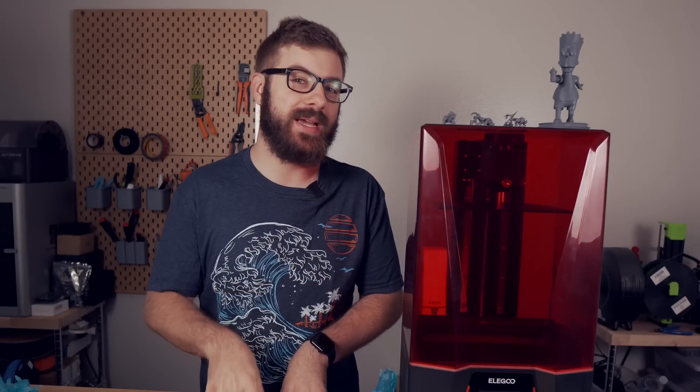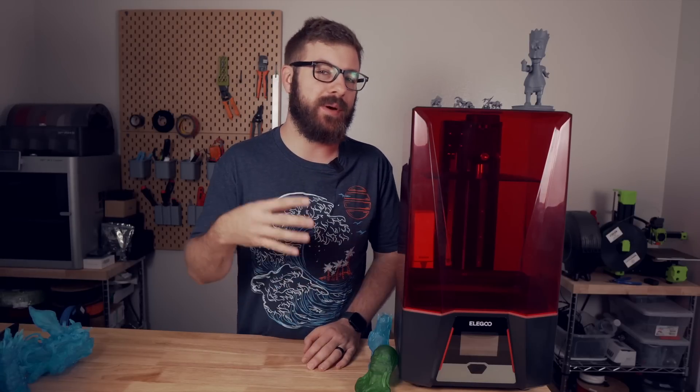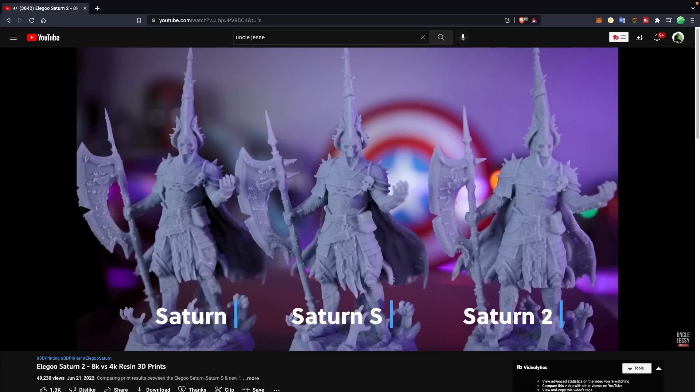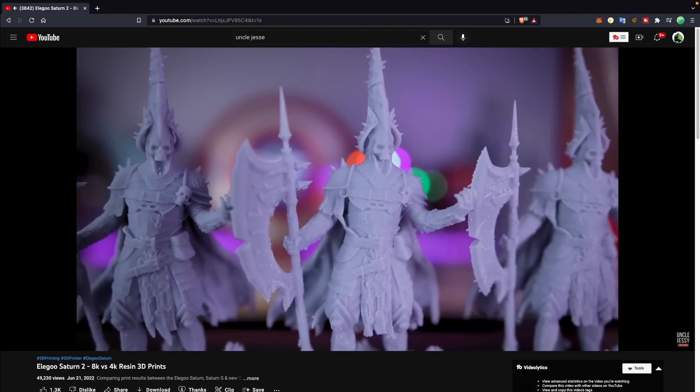My initial experience with the Saturn II was pretty frustrating and I'm really surprised that Elegoo didn't reach out with some sort of courtesy email to anyone that had received or purchased one of these machines early on, once the information about the provided leveling card was discovered. I'm not on Facebook very often and had that person not reached out to me, I probably wouldn't have used a regular piece of paper until I lost the included leveling card. If you're after the highest resolution resin 3D printer, the Saturn II is a great option and the XY resolution is substantially finer than the previous generation of Saturn machines. However, the original Saturn and Saturn S still look damn good and for many people are absolutely viable options. Uncle Jesse does a video comparing the same prints ran on each of the Saturn machines that is really interesting — I'll have it linked in the description.